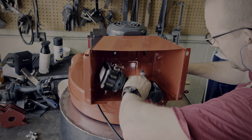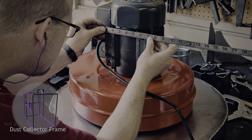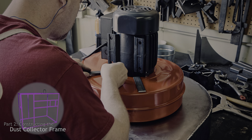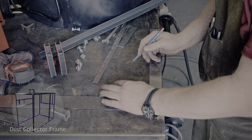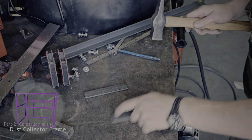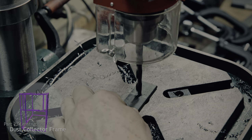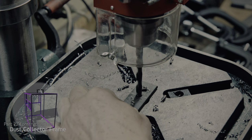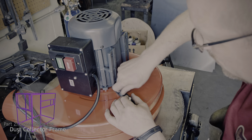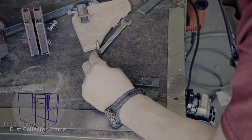I will figure out how to suspend the blower and the baffle from the frame that I will construct. I am removing the sheet metal stand and will build a frame from mild steel that can hold the whole blower so that the inlet points down. I am taking down the distance between the screw holes so that I can drill the flat steel bar at the same distance and then hopefully fit everything together just correctly. Before I drill the holes, I will carefully mark the center of the bar and then use the center punch to create a small indent for the drill bit. The blower is not really designed to run in this particular orientation so it will be interesting to see if the impeller comes loose more easily when compared to operating it upright.